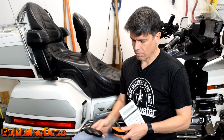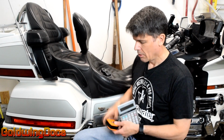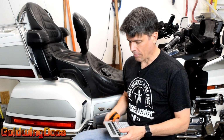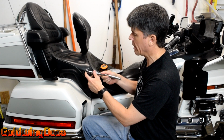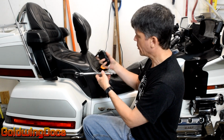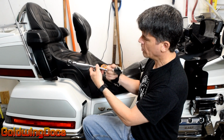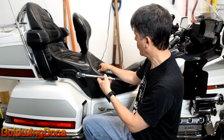Now I'm pretty sure the luggage scale you might have. You can get them for about $10. Measuring tape and calculator I'm sure you have already. What we're going to do is measure the distance between the rotational axis of the wrench, where the fastener actually goes, and where we're going to fasten the luggage scale. Now this wrench has a nice little divot right here at the end of the handle, so I think that'll be good. We can hook on there, that'll work fine.